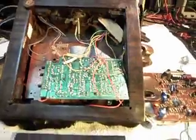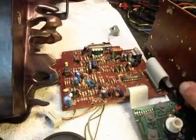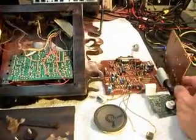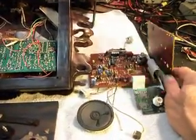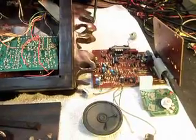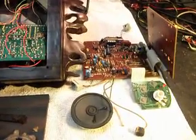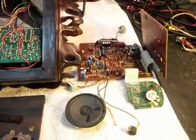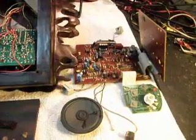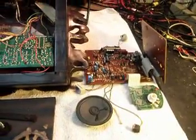So it's going to be a very difficult task to try to incorporate this board and still try to create some type of a volume. And you also have to think about these boards. It's not electric. It runs off the telephone line. So we're only utilizing the electric from the telephone line. There's no power supply, so you have to worry about quality. You want the phone to sound good. And to find one of these boards that runs off phone voltage from the telephone line and then have quality behind that, it's tough. So we're going to do the best we can with this.